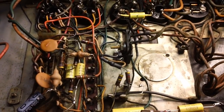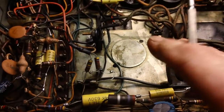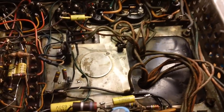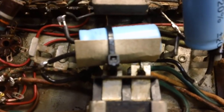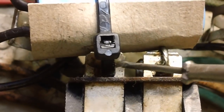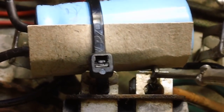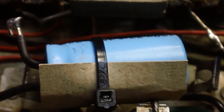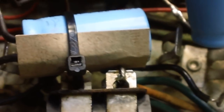Another tip of the day: whenever you're waiting for your soldering iron to heat up, always keep your eyes moving in the chassis you're working on. No matter how many times you've been in it, keep looking. While waiting for the iron to heat up, I got looking down around where the electrolytic capacitors are and I happened to spot this wire — one connection has lots of solder on it, and this one has nothing — not even soldered. I had missed that completely. That's why you always keep your eyes moving.